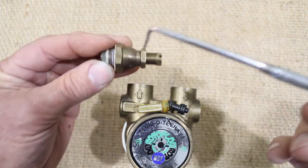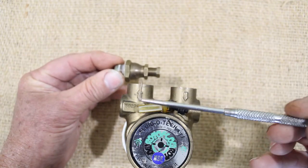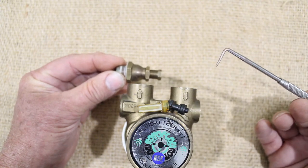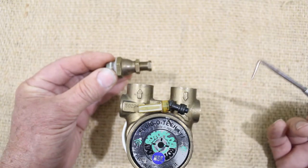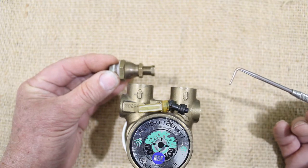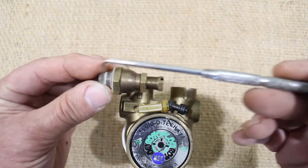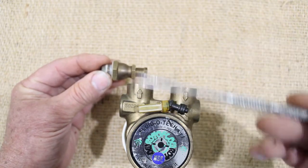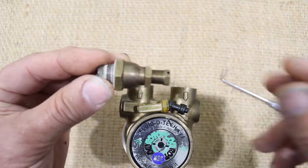It means that whatever pressure we apply here is the maximum pressure that can be applied to the entire water circuit. Thus, if we set a pressure of 9 bar here, 9 bar is the maximum pressure that can be achieved by this pump in our espresso machine. Likewise, if we wind that screw out, apply less pressure to the spring, say 8 bar, then 8 bar will be the maximum pressure that can be achieved by this pump in the water circuit.